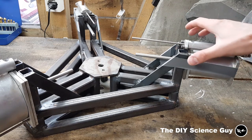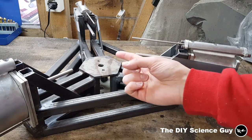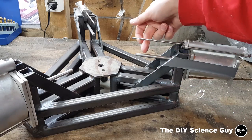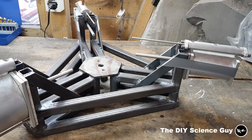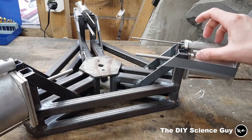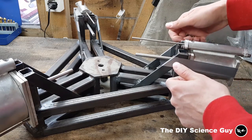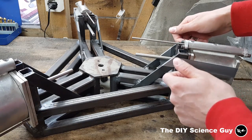And these crossbars make sure that the positions of the cylinders in respect to one another is maintained. And there's a little bit of torque, because the cylinder is pushing on the crankshaft at a slight angle. So there's some force in this direction, but that's of course a very small portion of that 50 kilograms. But these cylinder fixtures will be welded on here, so that mostly takes care of that torque. So these two parts don't bend away from each other, or whatever you would call that.